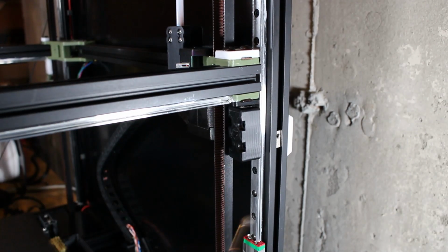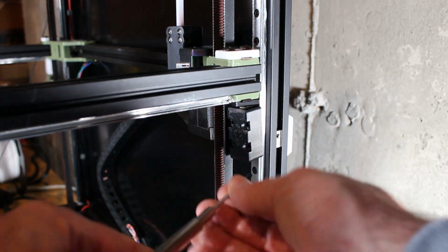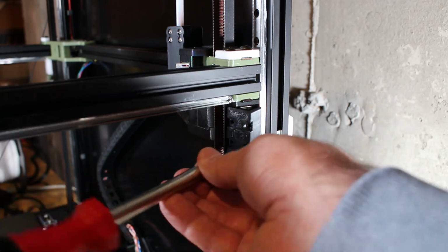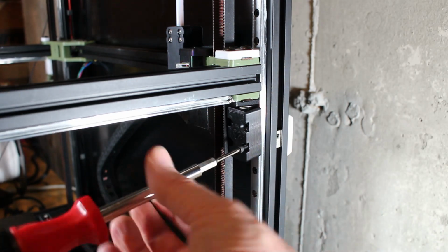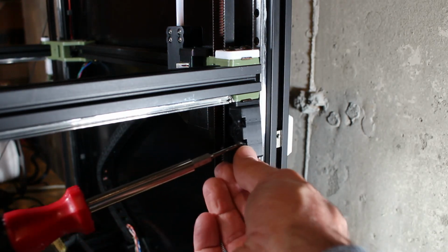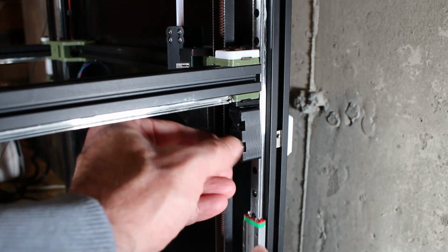So now I'm just going to move up the carriage for the linear rail. I'm going to use the 16mm bolts to attach these. Again, these are shorter than what you originally built your printer with. And here I'm just feeding in a little bit by hand to make it a little bit easier to align into the Z carriage.